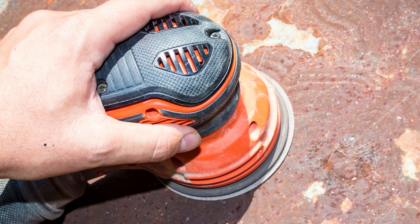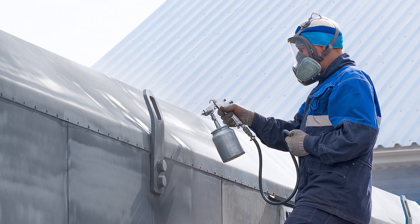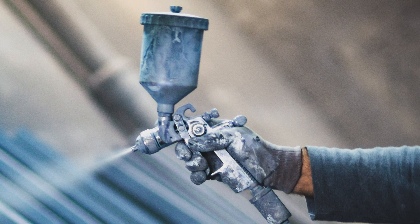The process starts with a low-pressure wash to eliminate all contaminants. Past that we look at corrosion and rust — it's not enough to wash it or prime over it, because you've left a condition that can worsen. We mechanically sand and remove the rust, then quickly spot prime those exposed surfaces, because if left 12 to 24 hours you get flash rust from air and moisture exposure. Once remediation is done, we apply a primer system per the manufacturer's recommendations with a 24 to 48 hour cure time, then apply the final topcoat.